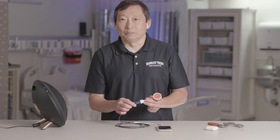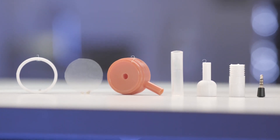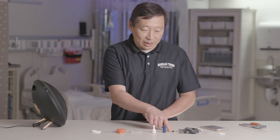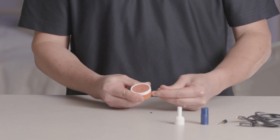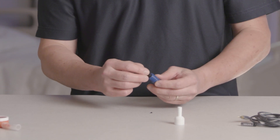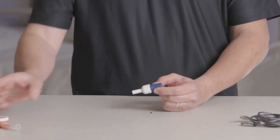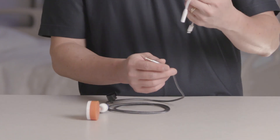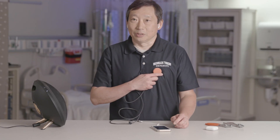We really had a goal to make this simple and low cost to produce and assemble. There are four 3D printed parts plus a little piece of diaphragm, a plastic tube, and an off-the-shelf gaming microphone. I'll start by taking the headpiece. One key component is this tiny microphone, and we have a 3D part designed just the right size that you can slip in this microphone. You just connect this microphone piece with the head, and then you have this cable — a TRRS — plugged into your phone, and then you're set.